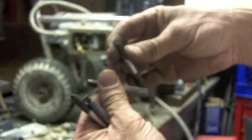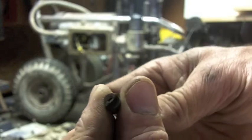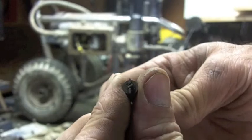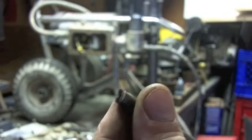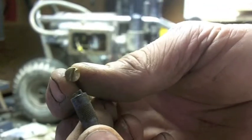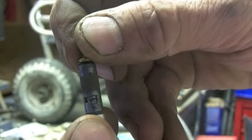Snap-on. I got two long ones, two short ones. The way these guys work, they're spring-loaded heads. I have two for Phillips heads and two for standard heads, and they've got these cool little spring-loaded devices like this, right? That's where they normally sit. You twist them and pull them back, and then you take your screw. In this case, this is the standard screw. This is the brass screw for the power. Press it on there, give it a push, ain't going anywhere. Way better than magnetic.